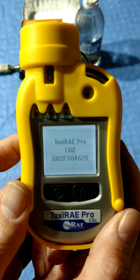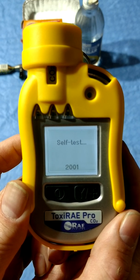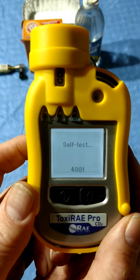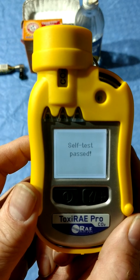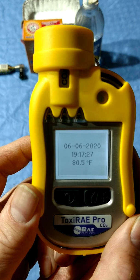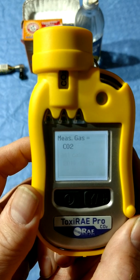The CO2 sensor is unique among our instruments in that it employs NDIR spectroscopy. NDIR stands for non-dispersive infrared. It's based on the fact that a chemical's molecules vibrate in a particular fashion and absorb light at specific wavelengths. Filtering light at such a narrow wavelength allows for the chemical's detection and measurement.